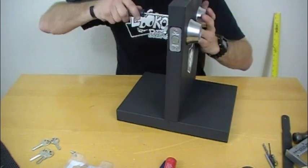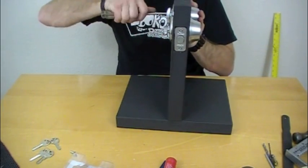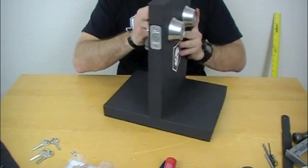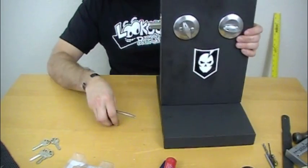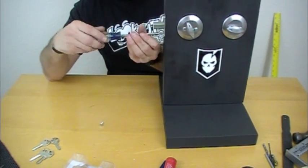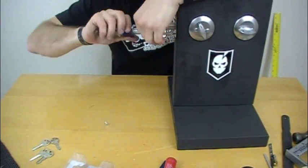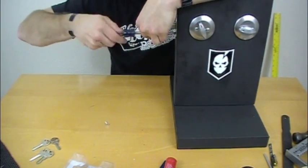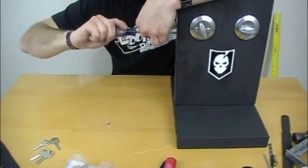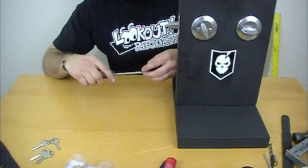You do have to be careful not to go crazy with the chisel and chisel away too much wood. All you're going to do is tighten this thing up, just like so. Make sure your deadbolt works. Now you're going to put in the screws on the side here — I drilled pilot holes for these as well. And just spray painted it. Obviously I painted it without the locks on.